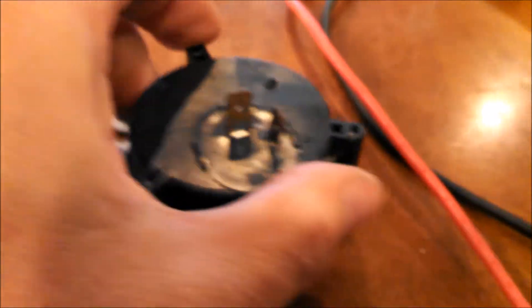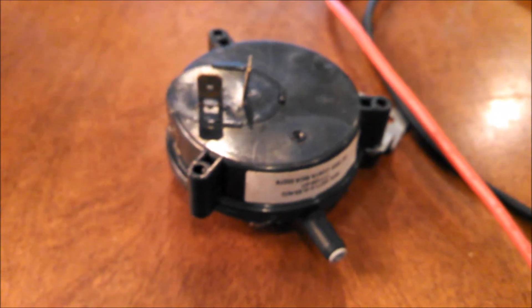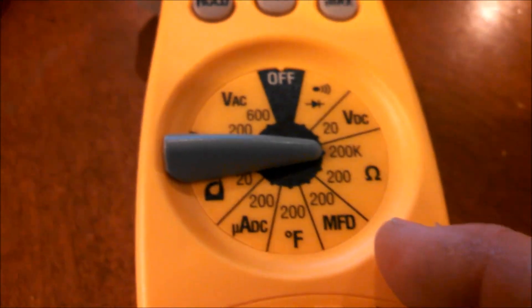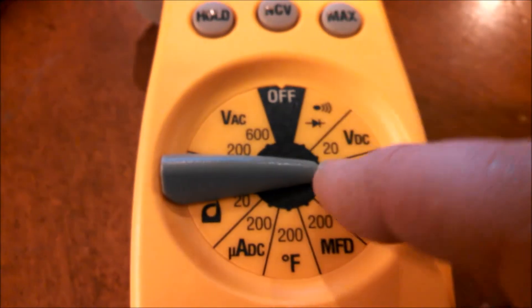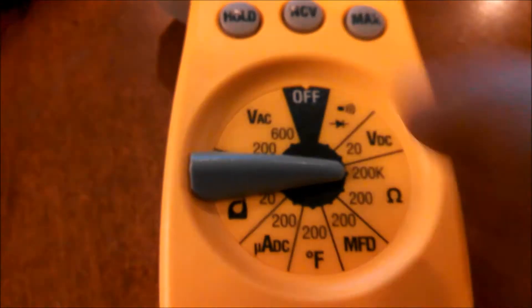So that's what we're going to measure here. I'm going to put our leads on here and show that this is normally open, then rearrange the camera angle and suck on it so you'll actually hear that the leads close. We're back over here with our Fieldpiece SC66 and we're going to check continuity, which is the little section up here with the alarm indicator on it.